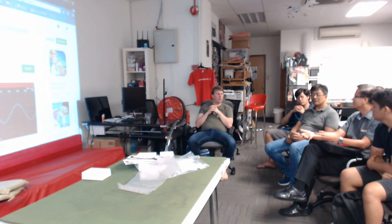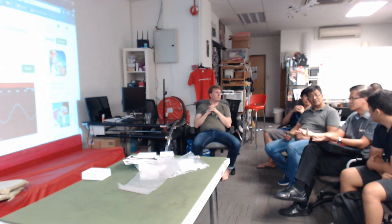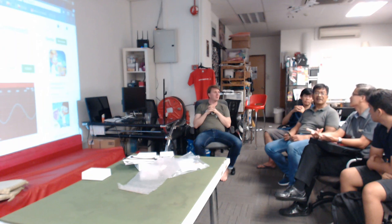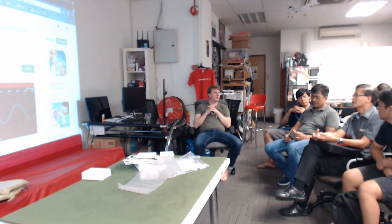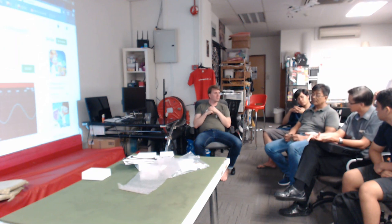I can give you some advice. That would be an oscilloscope. An oscilloscope is measuring AC, but a true AC voltmeter is different. Those are things that have to be clarified. Your oscilloscope is 2 megasamples per second, so what is the bandwidth of your oscilloscope? You have to establish that.